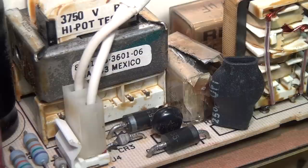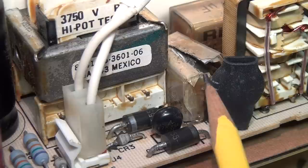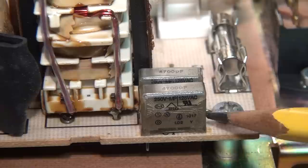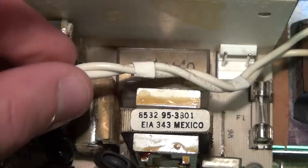So even when the computer is not in use, as long as it's plugged in, this capacitor is energized — and that's what causes it to fail first. That's also why turning off the computer will not stop these from smoking out once they do fail; you have to unplug the power supply. These two smaller ones say 4700 picofarad and are marked Y, which indicates these are line-to-ground safety capacitors. The big one in the back says 0.47 microfarad, but I'll need to desolder it to see what type it is because it's blocked by that transformer.